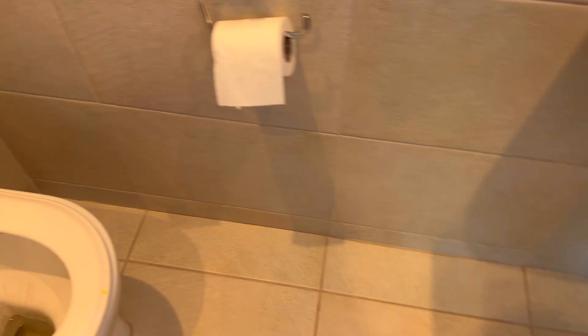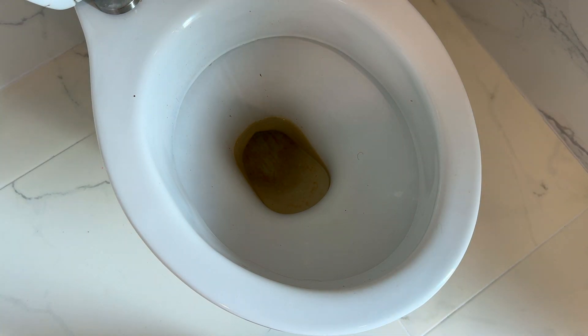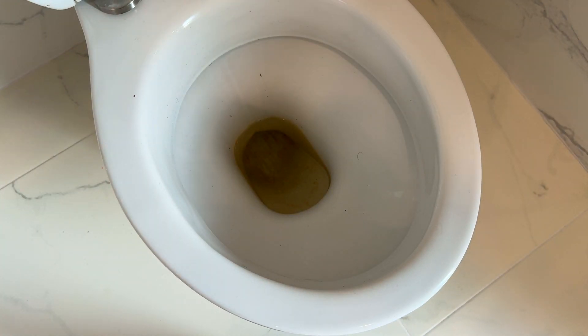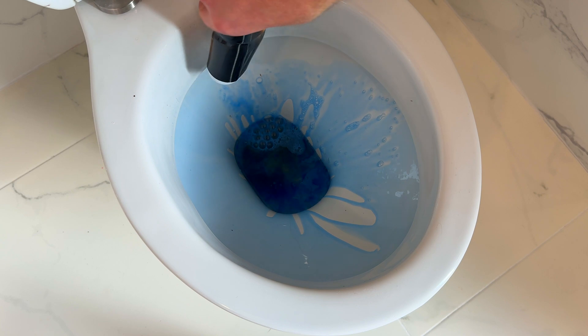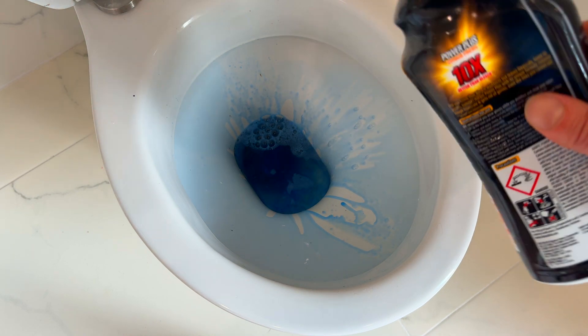Excuse the mess — doing a spring clean. I'm going to test the bleach on the toilet with all of the lime scale to see if it does anything on it. So lime scale remover upstairs and bleach on this toilet down here. My subscribers will be very familiar with my love for pH paper. pH will indicate basically what pH anything is — whether it's acidic or alkaline. So I'm going to put our Lime Scale remover, which is acidic, into the toilet. I'm not doing any scrubbing on this just yet.